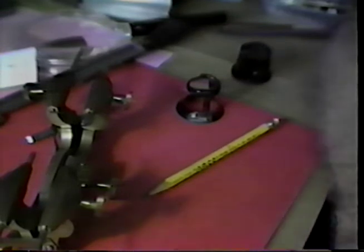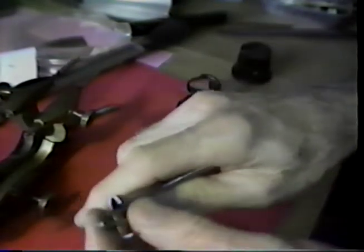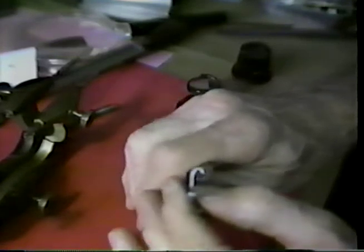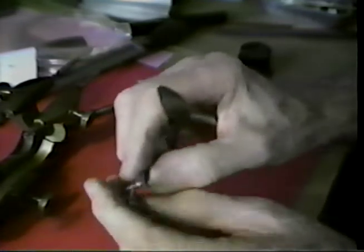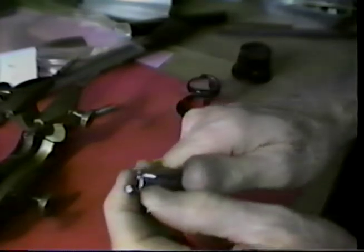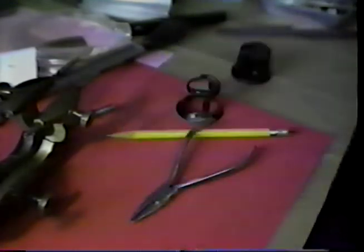Let's set this thing up so that we can put it into the movement without touching the height of the bridge. Be back in a moment. With a smooth jaw plier, you'll just form this down slightly there, and we'll pull this up a little there, and we'll do approximately the same on the other side. All right, let's see how we're doing there.